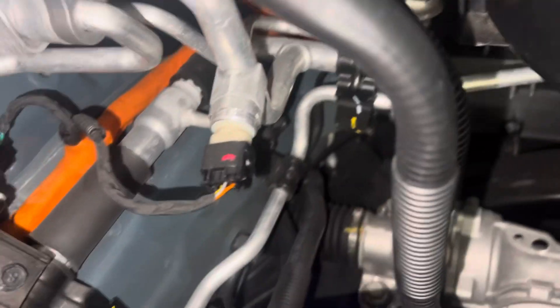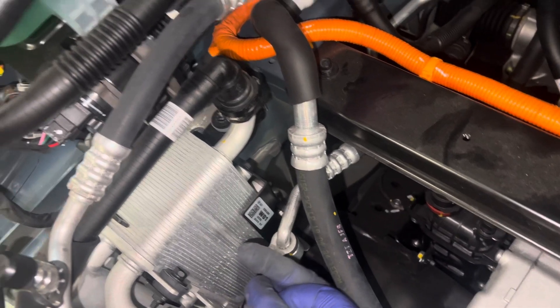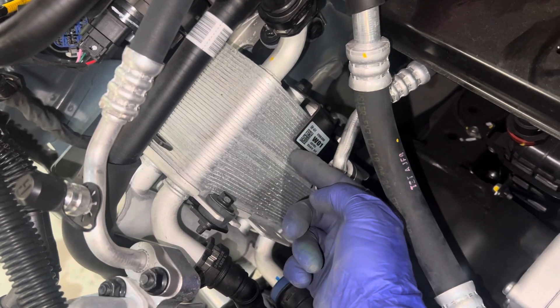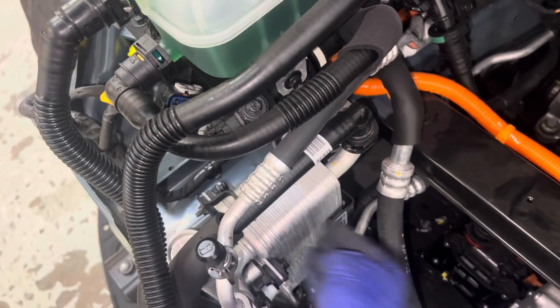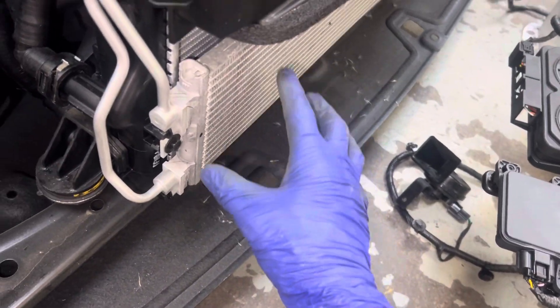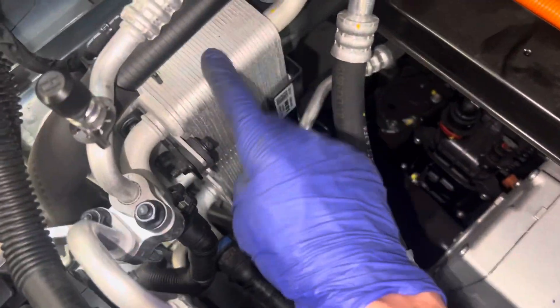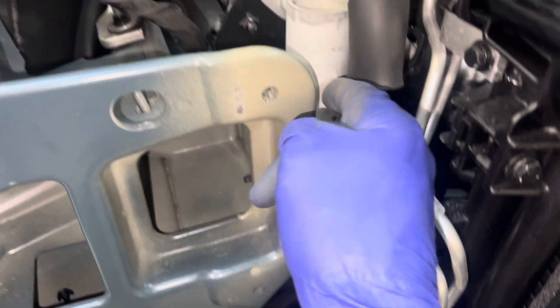Follow this — look what we're coming to: a plate heat exchanger. Keep following it — it goes underneath and the pipe just goes around and comes out and goes in there. That hot gas goes through every other one of these little plates. What do you see here? Coolant — glycol coolant. You can call this the main condenser, a plate heat exchanger. And sticking off the side of it, that looks an awful lot like a receiver dryer.